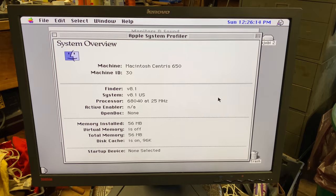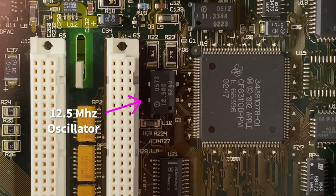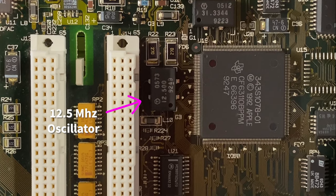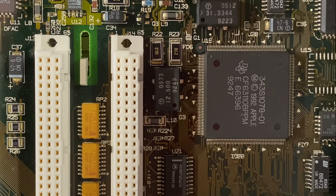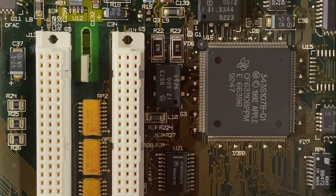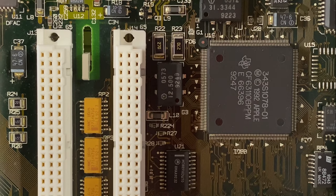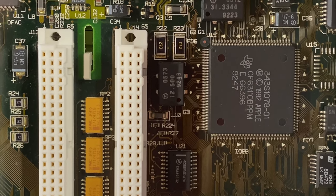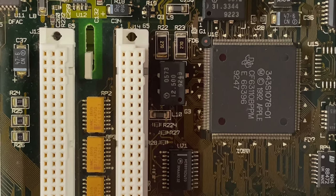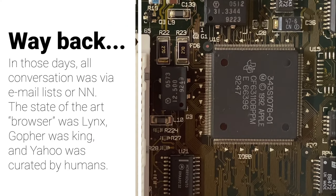That's a 12.5 megahertz oscillator. You can see that 12.5 megahertz oscillator sitting there — that's what makes the computer tick. It's possible to change the speed however. This is an output-enabled oscillator, so you could disable it and introduce another oscillator to speed up the computer, and that's exactly what was figured out back in the day by the clock chipping geniuses.